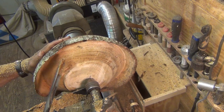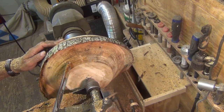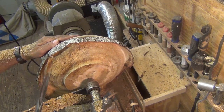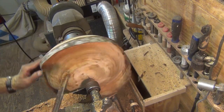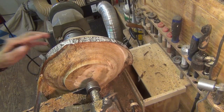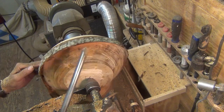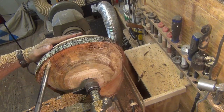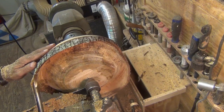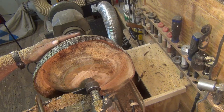But also, at the same time, I have not decided on whether I want this to be a whole bowl or if I want it to be somewhat of a hollow vessel. And I'm kind of leaning that way, making a rim right over here and undercutting it back. But no matter what I do, I have to bring this in until it at least makes a return, something like this on the edge. I don't want the edge to roll off. I look at that as a non-planned piece, where if I have this slip, then the whole piece is uniform all the way around. I still have a little bit to take out right here, which I don't have the sharp, crisp edging of the bark, even though it's not going to maintain, but I don't want this blunt over here. I got it good here, but not here. So I gotta pull out a little bit on that area right there.